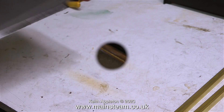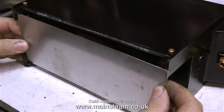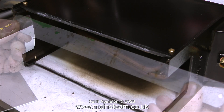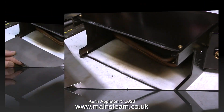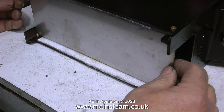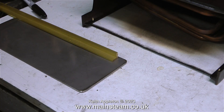So why am I making a heat shield? Well, have a look at this. This is from one steaming and you can see the amount of heat that the sides have been subjected to. None of it got through to the paint because I used a double layer of heat insulation, but by fitting this heat shield it will be a real belt-and-braces approach, plus the burner will be properly supported. I once built a Stuart 504 boiler plant which had an original 504 spirit burner, but in no time at all the baseboard became very badly burnt. So to prevent that happening again I'm going to use a controllable gas burner, and to stop it cremating the baseboard I'm fitting a separate floor in the bottom of the boiler using one of the pieces of stainless steel. The other two pieces will be mounted vertically as an extra pair of heat shields and heat reflectors.